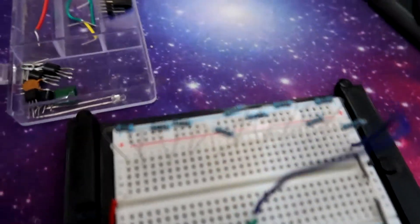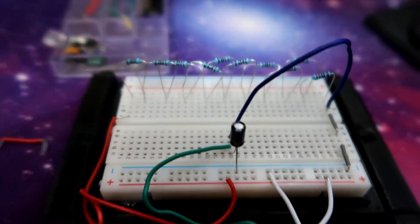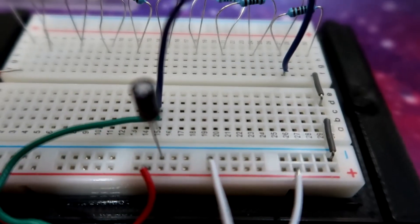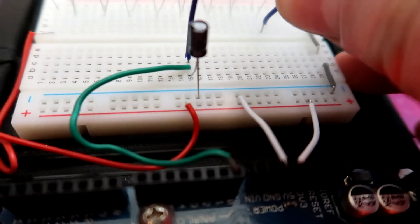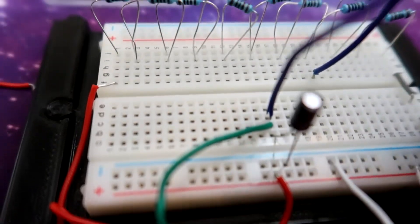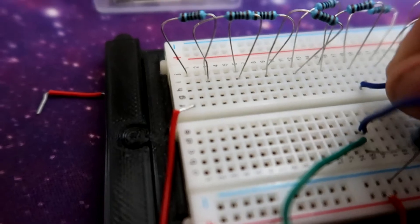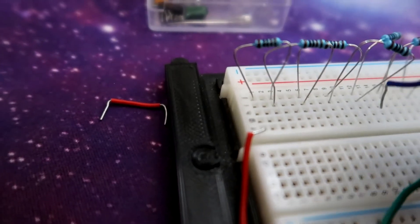Since we don't actually have the rotary switch, we're going to use that blue wire and plug it into each of the legs where the resistor connects up to — it'll act like a little switch clicking between positions. What the Arduino will see is that every time we click between each of those resistors, the resistance value will change. For example, at the front end where the 5 volts are, we only have 1k ohm of resistance. When we move to the second position, we have 2k, then 3k, 4k, 5k, all the way up to 12k if there's a 12-pin rotary switch.